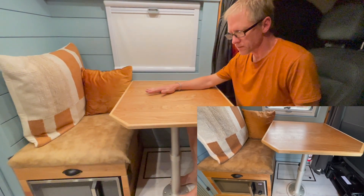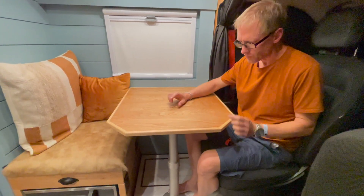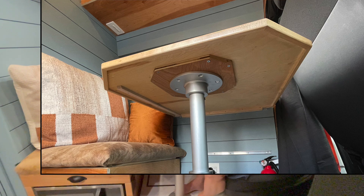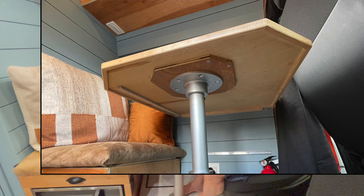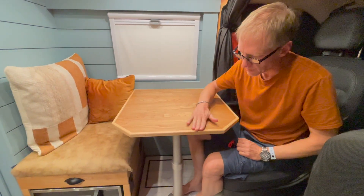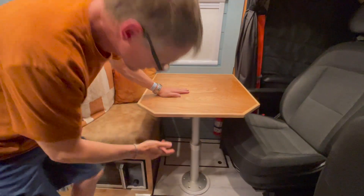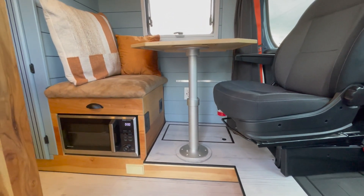This table is made out of a piece of half-inch birch plywood from Home Depot — it's very light. I bought a piece of three-quarter-inch maple for the trim, which hangs down lower than the thickness of the table. I glued the maple trim around the edge and shot it with a brad nailer, then sanded it to make it perfect all the way around. If you want to get fancy, you can add an extra bracket — I'll show in the description where to get the brackets and the table mount.